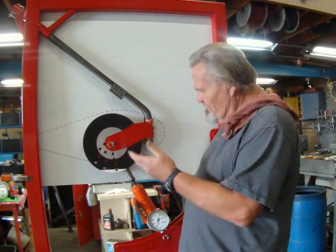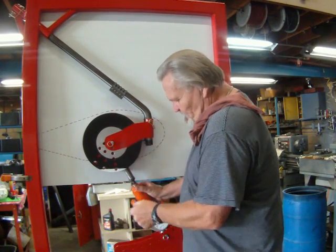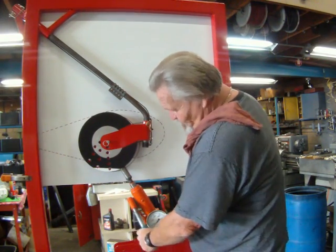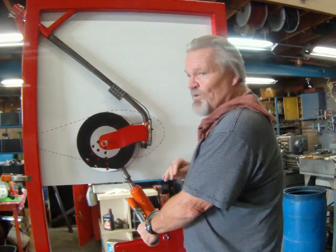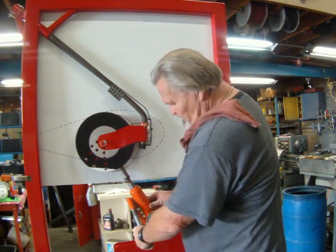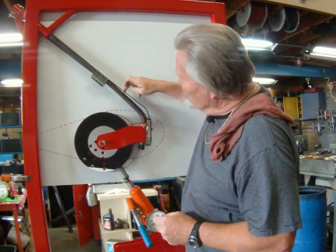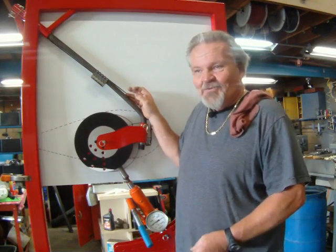So now let's try the bending again at the same position as we had before, and just see what we get. So here's only 200 pounds. There's 300 pounds, 400 pounds, and we're already at the point where we were with the gear brace on and had 1,500 pounds of force against the wheel. So there's 500 pounds, and much more than 500 pounds in the gear is at the point where it yields here, and much more than that and it won't come back. We've kind of learned it from experience by destroying a few gear legs.